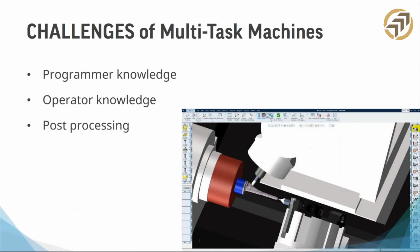All right, so next. This one's really huge. The idea of this presentation is to give people, customers, machinists, whatever you would like to identify as, an idea of how these machines work. One of the ways it works, in case anybody on the call doesn't know, is post-processing. Post-processing takes that cartoon you see on your screen and turns it into text that the machine can read. That translation is very, very important. When you use a CAM system, you have to make sure they have a good post-processor for your machine.